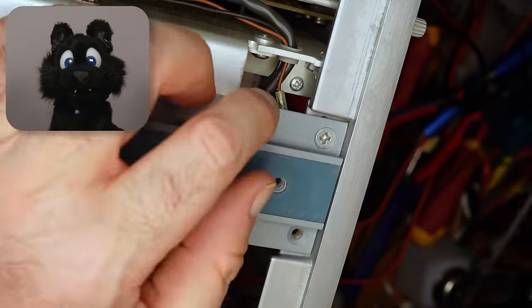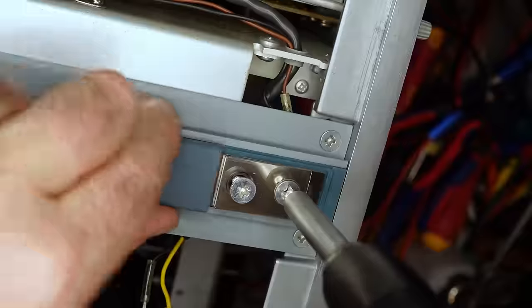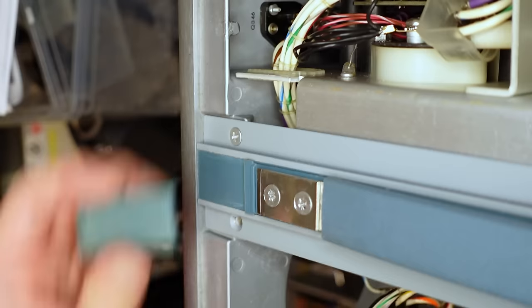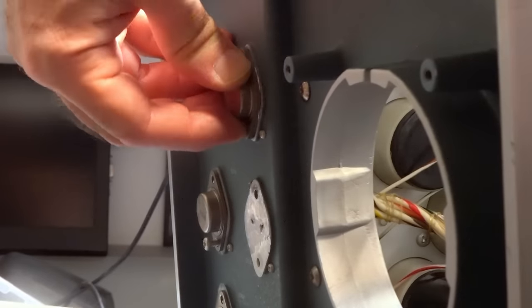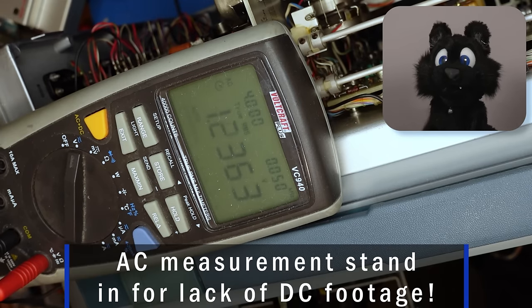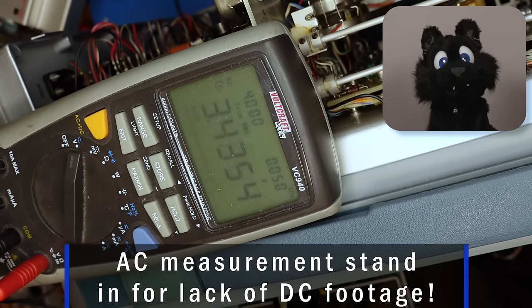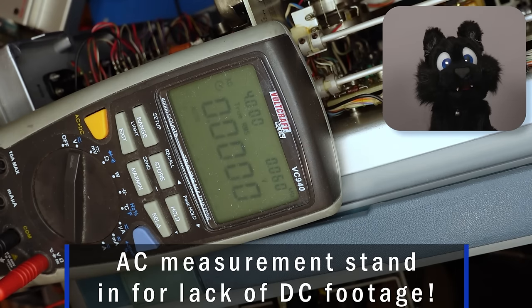Finally getting a grip on things again, mounting the handle. And finally, power on time. Still without the CRT for the first try, I bring up the voltage slowly and see if the DC rails show normal values. When shorted, there would be next to zero voltage. So far, all good.